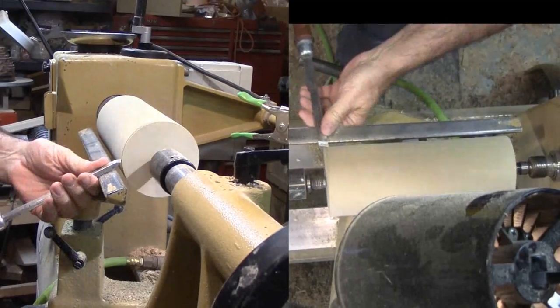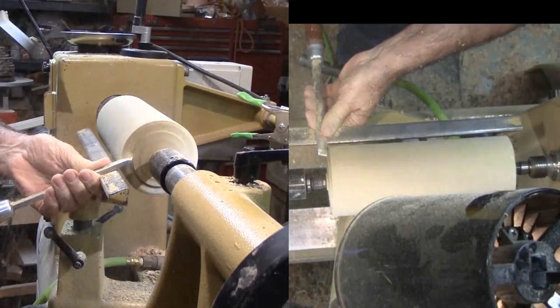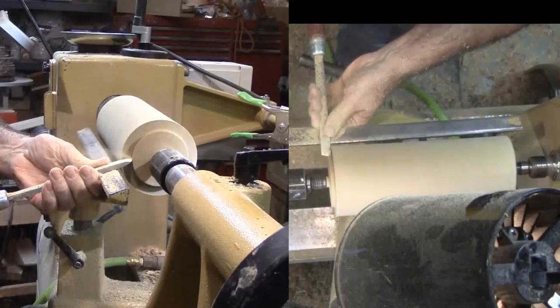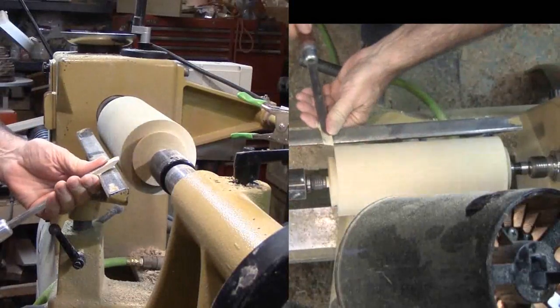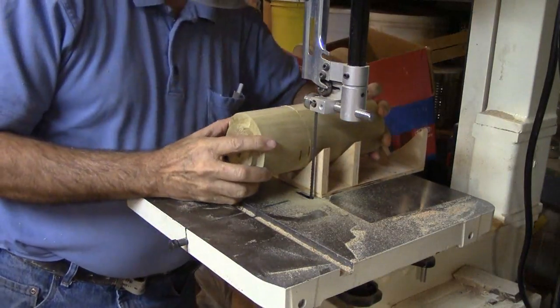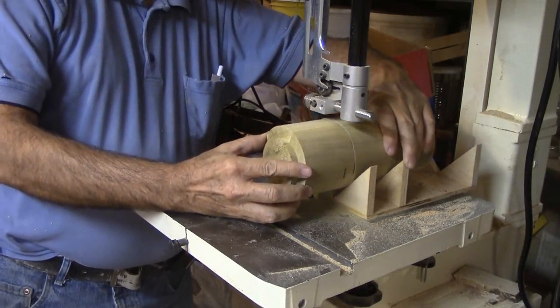I took a tool and widened the hole in a stylized area where perhaps some form of bird broke out of this egg — so let's make an egg-shaped work of art. To start with, I glued two pieces of poplar. Poplar is not an especially pretty wood, generally considered paint grade. I thought it would be perfect to use for this mold. I roughed it out already; now I need to cut tenons on each end for mounting to a chuck. I'm using my skew to peel down to form a tenon. Rather than part the wood in two on the lathe, I'll cut it on the bandsaw. My V-table helps make this cut safe.